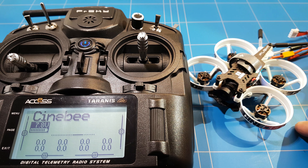We're using the FrSky X9 Lite radio with OpenTX and D16, which we needed to bind to the XM receiver. Then we set the failsafe and the inputs, and now we have to calibrate the ESCs. As just seen in the intro, it doesn't work the normal way you're used to. To calibrate the ESCs of this little drone we have to go into Betaflight.